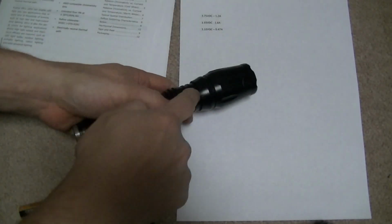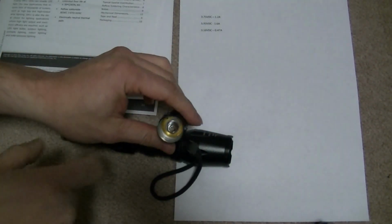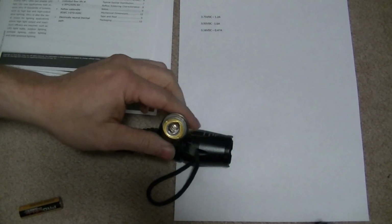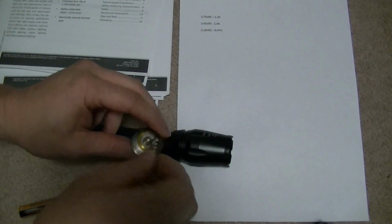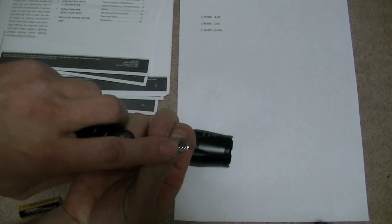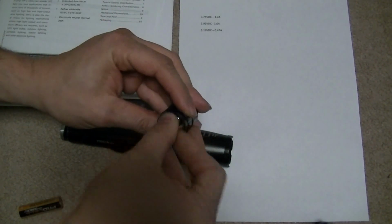After I broke it, I had to move the spring from this end to this end, because when I tried to pull the board off, it pulled the spring off. I could not solder it back. So I just expanded it out, stretched this out to where it was large enough to fit on here, and put it there instead.